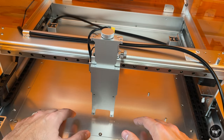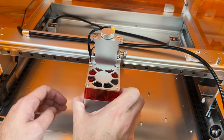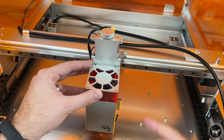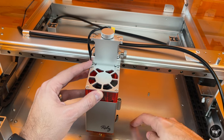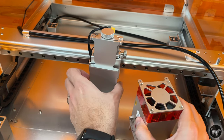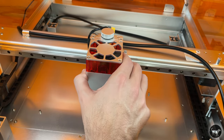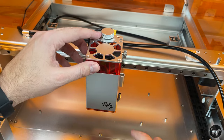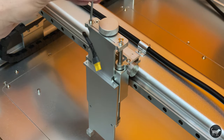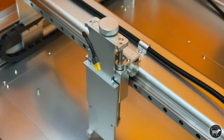You do have to remove a few screws on the gantry itself to unlock it. The gantry also has a laser height extender already installed on the machine. You can remove this for the regular operation of the laser. This would only need to be used if you want to engrave on objects much further down on the bottom surface, which I'll talk about in a second. Be sure to hold on to the screws that you remove off of this part since they will be used to attach your laser module.